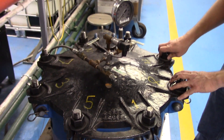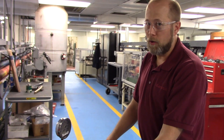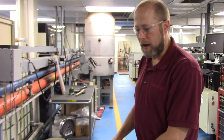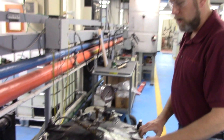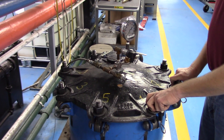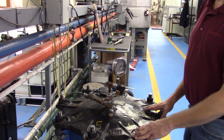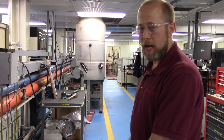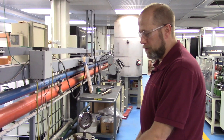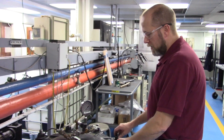When it comes to torque values, it's important to recognize that manways can come with either a 7/8 inch or a 1 inch bolt. They also can use lower strength A307 bolts or higher strength A193 B7 bolts. It's very important to know what size and grade bolts you have because that will determine how much torque you can achieve. In this particular case, these are 7/8 inch A307 grade bolts, which are a lower strength bolt, so we're going to use a lower torque value. One of the greatest benefits of the tough rail gasket is that the product is able to seal across varying ranges of torque value. Even if you have a low strength bolt with only 6 bolts versus 8, it has the ability to seal with very low torque of only 50 foot pounds. Likewise, if you have 8 bolts with 1 inch bolts, the tough rail gasket can handle extremely high torque values, upwards of 250 foot pounds.